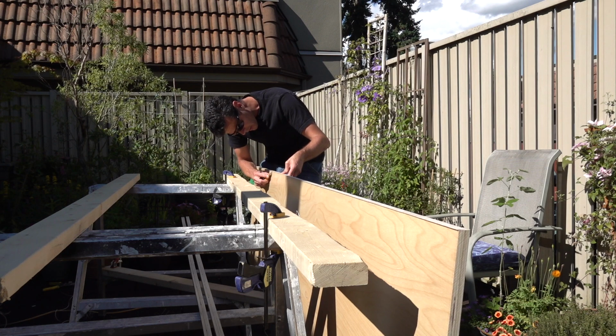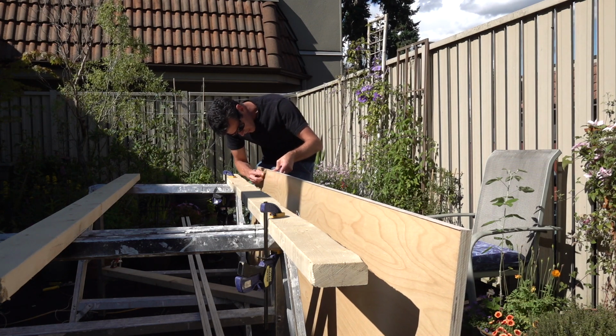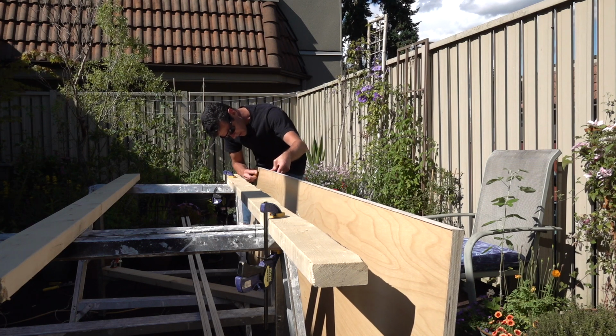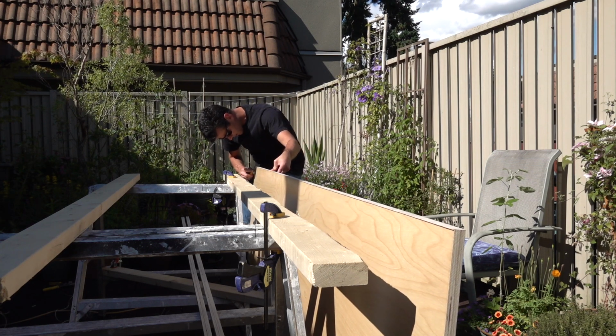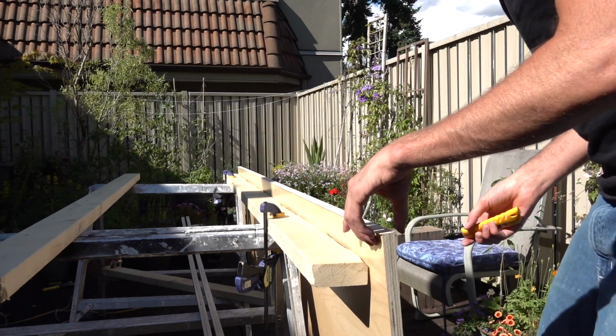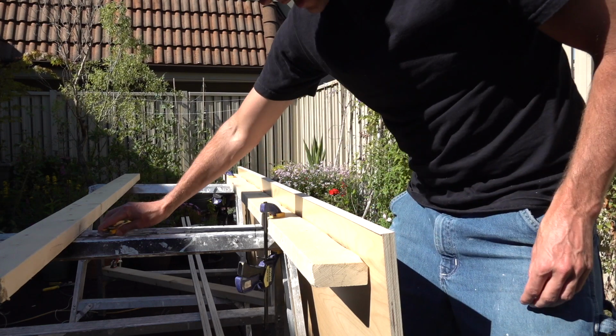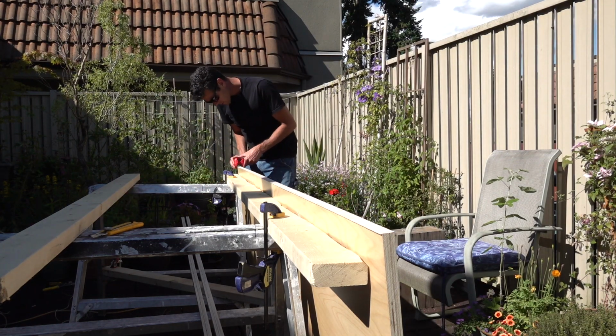Because sometimes, if the edge banding isn't put on perfect, and you have a mil or less on one side, but you have 1/8 of an inch sticking out on the other, it's the side that has a lot of material sticking out that seems to tear. All right, this side, it doesn't stick out much. This side right here is sticking out almost 1/8. But overall, it's still way faster than the chisel.